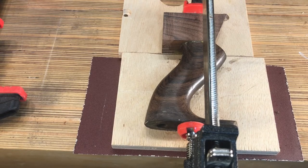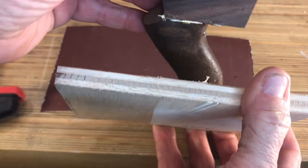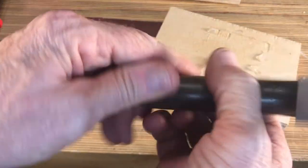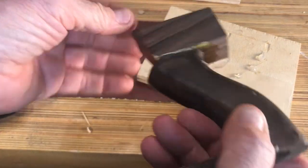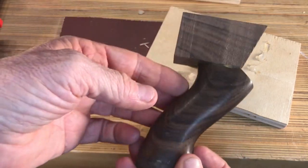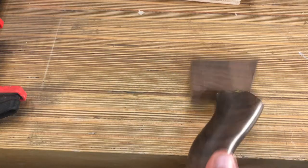Fast forward to day two. We've let this dry for 24 hours, so we're going to give it a look. We've got a nice bond there. I just popped this right off — I didn't even need a razor blade or sharp chisel because I don't want to get into my rosewood. The glue is enough to hold it and keep us safe when running the saw, but it's also forgiving enough to let go. There's our bond — this is Titebond II. We've put a piece of Bolivian rosewood on top of our Brazilian rosewood.